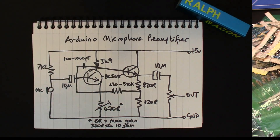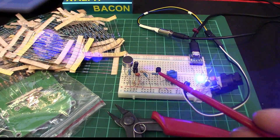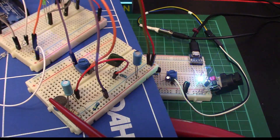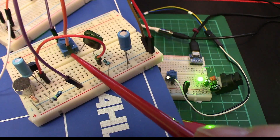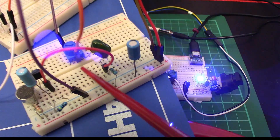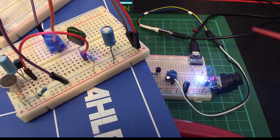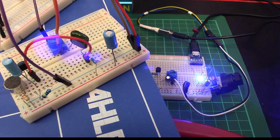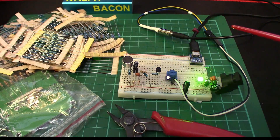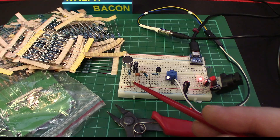This is quite a bit better than the original amplifier, and it's still wired up to the Christmas tree project. That's the single-stage transistor amplifier — which worked, don't get me wrong — but the gain wasn't really high enough and there was a little bit of noise. If you're going to stand a Christmas tree up in a room to pick up voices, TV, or music in the background, you need more amplification. So we're using a bit more maths to determine the feedback via that resistor.